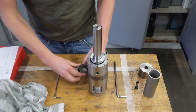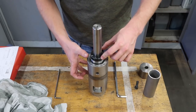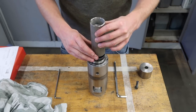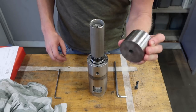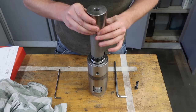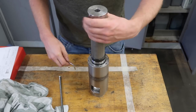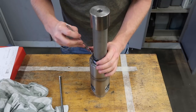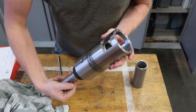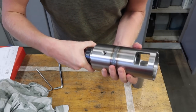Clean it up a little bit. For the clamp, slide it over. Now I will use this tool to push this part down and to take out the slack in the bearings when I fix up the coupling shaft into the bearings. This part has a hole inside with a face for the bolt. I'll use this bolt to take out the slack. Now to fix everything together I'm just going to tighten up the shaft clamp. Don't forget to screw in a grease nipple and fill the bearing housing up with grease to make everything last longer.